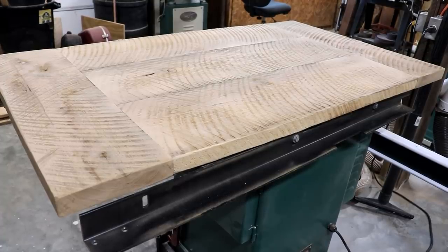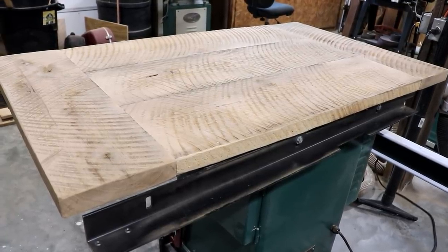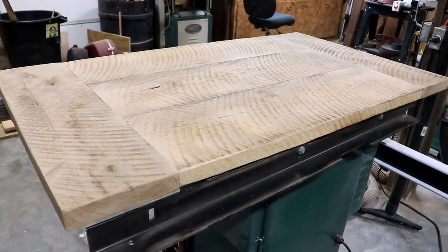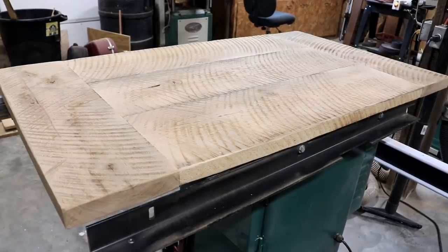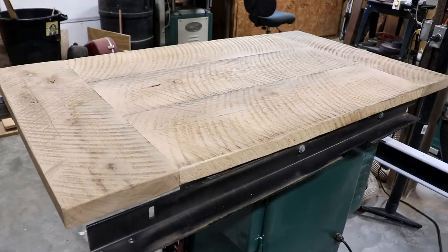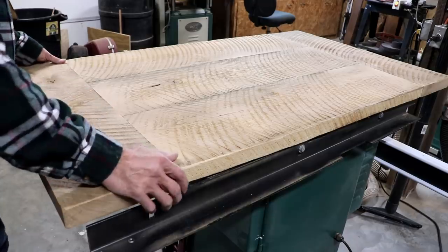Here's a look at the tabletop after it's laid out and sanded lightly. We want to leave the saw marks in there. She wants a real rustic looking table and I don't think you could get one much more rustic looking than that. I believe it's white oak and it's been just sawed from a sawmill, drying in the barn for years and years. So it's pretty dry, but it's not kiln dried — there is a chance it will change when you put it inside a house for a length of time. It is what it is. If it comes apart, we'll either fix it or recycle it, but I think it'll last a very long time.